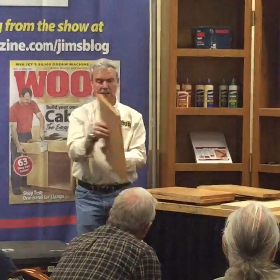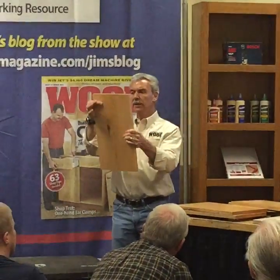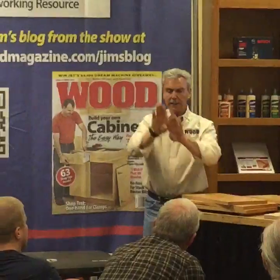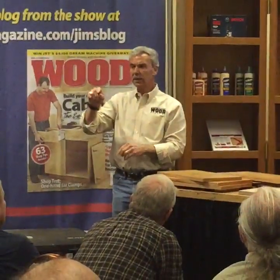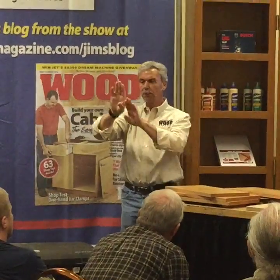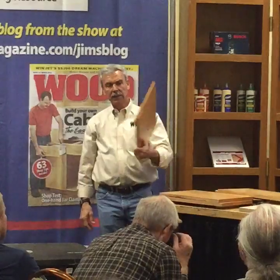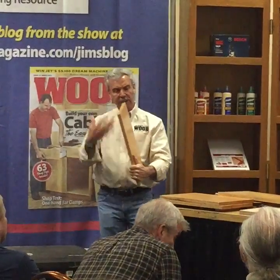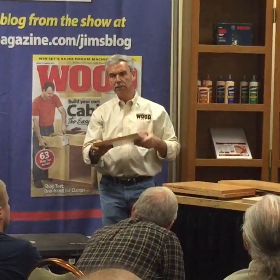But if you take that, let's see if it shows better here. If you take that board and run them up against each other like this, you can put that cathedral back. You may have to cut a little off the top and the bottom, but the point is you can make this board look exactly like it looked before and dead flat. So in effect, it's operating like two 5s, but it looks just like the old 10-inch wide board.